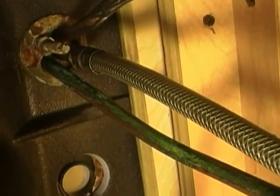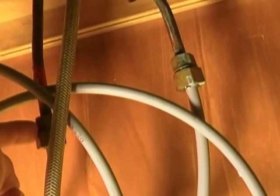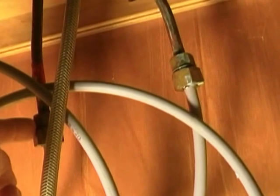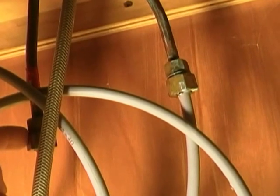Now step number two, after you get that broken loose: come down here and you can see where your water lines tie in. The hard line that comes from the faucet itself ties in with the lines coming down to your shutoff valve. We're going to take two wrenches and break these loose. We're going to disconnect the cold water and the hot water. We're going to do all that between now and the next video, so go ahead and get your wrenches out, remove all this stuff, and then check out video number 2.